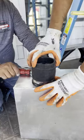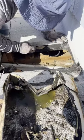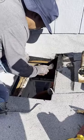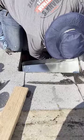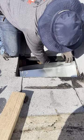This is the new scupper — we actually had to custom order it. The way you do that is you measure the existing one: the width, height, depth, and position of the drain hole. You want to be very precise, and once you have all those measurements you send them to the manufacturer. We have one locally and they were able to make one pretty quickly. The hole is three inches wide.